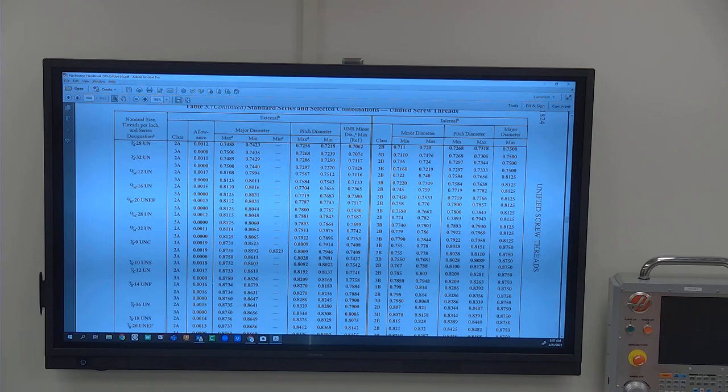I have students oftentimes, I'll say 1/4-20 tap, and they'll drill it a 1/4 inch. And I'm like, you got no material anymore. Got to drill it .201, .203 in order to get the 1/4-20 threads. All right, so 3/4-32, 2 for the size. What am I going to drill it or bore it to?